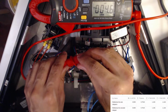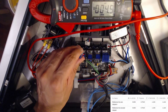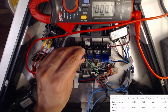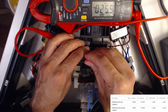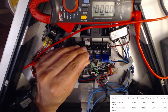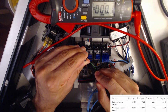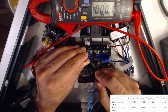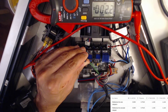Okay, if I move the heat sinks and things away. Okay, so plan is, and I'll just do this with rough to start with, just so I'm doing the right thing. Plan is to take that screw while holding the probe over the ground wire, which is this one, and measuring the voltage. And the numbers that I need are up on the screen in the bottom right. So for these, I need 1.193 volts. See how it goes.